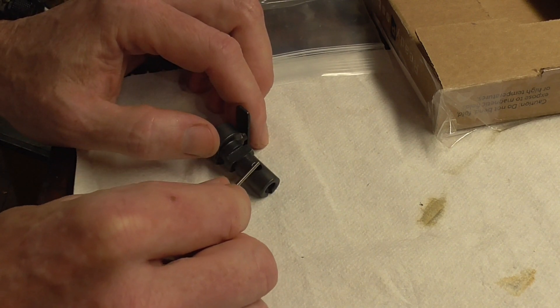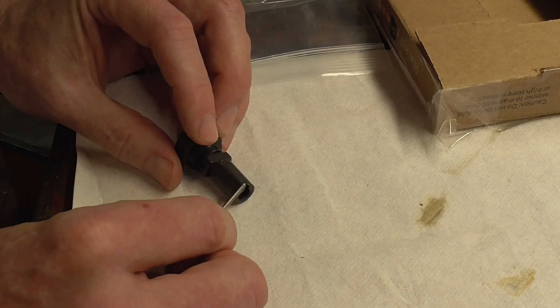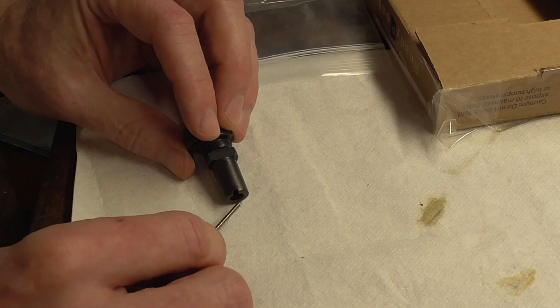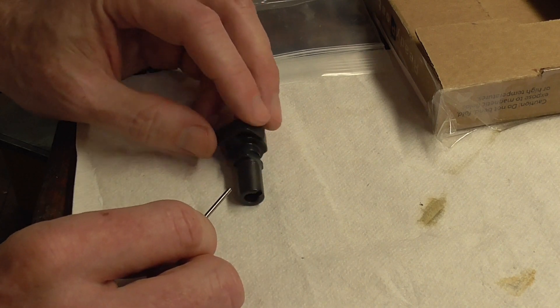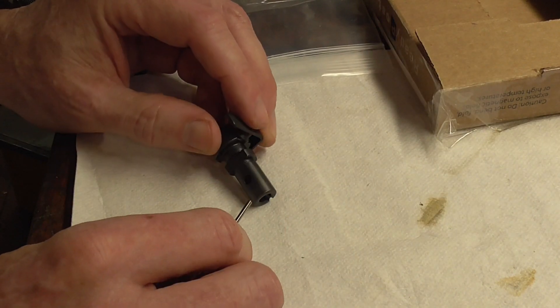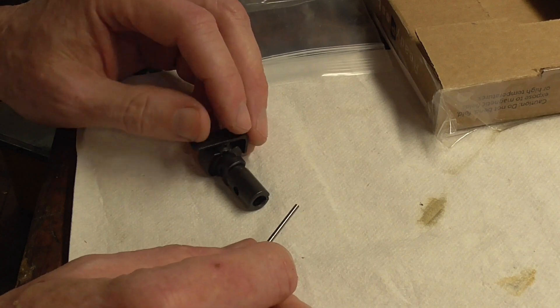What I do is basically V-cut this and grind a little bit here. This hole lines up with the vent hole in the gas collar, so I weld that back up and make it flush, to limit the amount of high pressure gas that's popping out of the gas collar. Because that's also a place where the noise occurs.